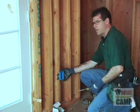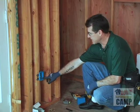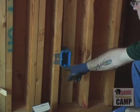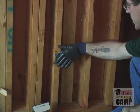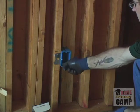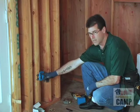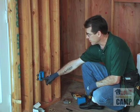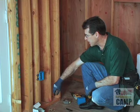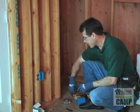One thing they've got to be careful about is that lots of times the sheetrockers are using roto-zips, a method of cutting around the box. They're actually supposed to cut around the outside of the box with their roto-zip. They put the sheetrock up and cut around the box. What they do is start in the middle and find the edge of the box blind, and they wind up cutting our wires inside. So when you're detailing your boxes, you might want to shove your wires as far back as you can, in case you have someone that's not particularly skilled doing your sheetrock for you.